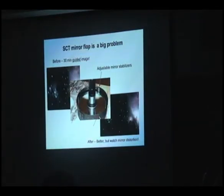And what kind of material do you have in the plastic? What kind of plastic is it? It's black Delrin. So it's kind of greasy. It's got kind of a self-lubricating quality. And they're sanded so that they fit the profile of the round mirror. Those little plastic tabs are not hitting the mirror in one spot. They're hitting it kind of all around.